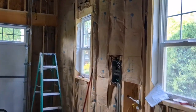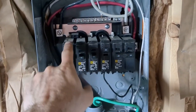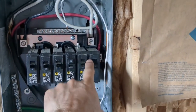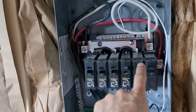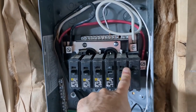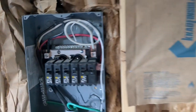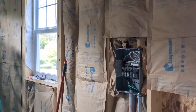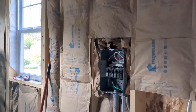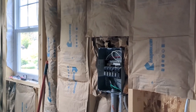The goal of this electrical: I've got a 60-amp panel here with just five circuits, including the 220. The 220 circuit runs to the workshop for the compressor, and then there's one 15-amp circuit for all the rest of the workshop lighting and outlets. There's not much going on since it's just me working in here — LED lighting and just a few outlets in the workshop at this point.